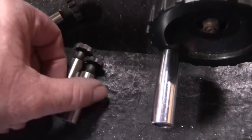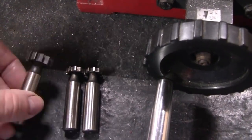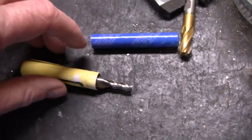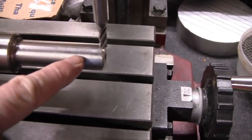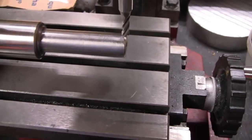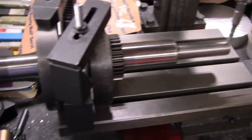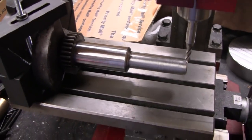And I had keyway cutters, and I thought I had the right one because we've cut 3/16 before. And it turns out I did have a 3/16, but Mike borrowed it, and it's at his house. So I even got a brand new 3/16 cutter here, but I figured I got to go see Mike anyway. And when I was cutting the end of this, I was hitting like hard chips, and I think that was because it was breezy today. The kid welded this, and I think we might have to anneal this anyway. That way I don't ruin a good keyway cutter. So I'm going to take this out of this machine and bring it over to Mike's and put it in his big machine, and it'll probably only take a couple minutes. So maybe I'll stop and pick the kid up on the way over there. So we'll see you over there.